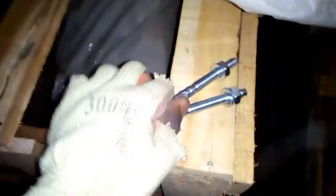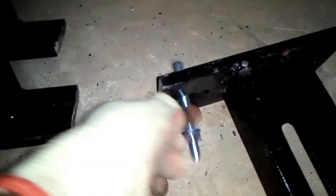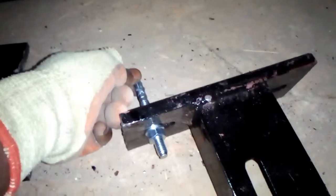This is how the bracket will go — here will be the wall and the anchor bolts will pass through here. Let me show you the anchor bolts. They come through a polypin — these are the anchor bolts. This can rotate: you hit this into the wall, you tighten it, and it will be hard. This is how it will go into the wall — this part will be in the wall and this one will tighten. Our brackets will come like this, held over here, and will be on top.